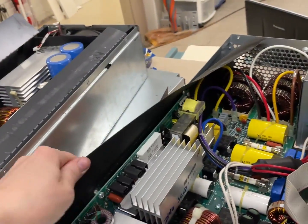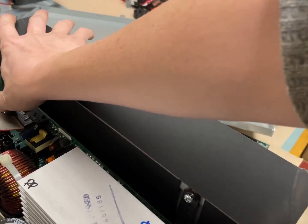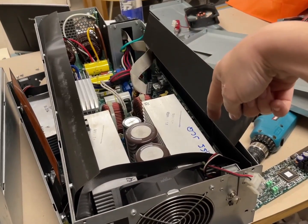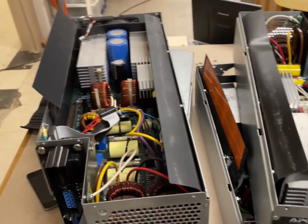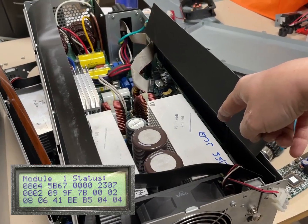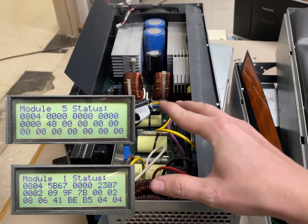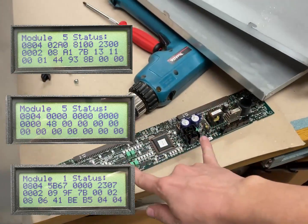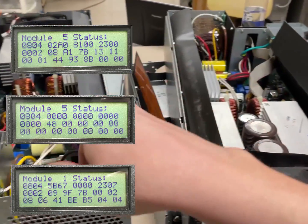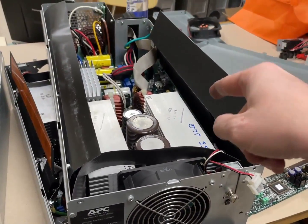Let's take this control circuit out, disconnect the fan, take this communication card, and put it into this other one. This one was working fine with no faults. This is the chassis that had no communication, and when I put the faulty card in from this one, it showed those faults. So this could be a good A-B comparison — bad communication card versus no fault.